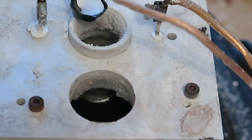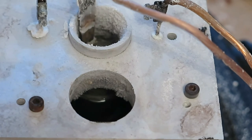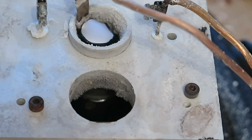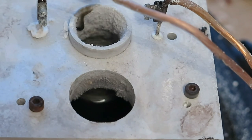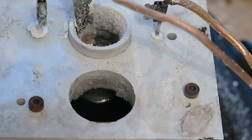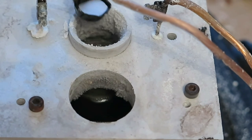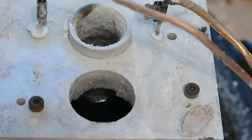Typical yield for this setup is about 10 grams of sodium metal per hour at 40 amps. After all sodium is collected, it is good to remelt the solid in the collection tube before starting a new batch. I didn't run the cell continuously for more than an hour. Shortly after an hour, explosions occur inside the cell. Once, a few grams of sodium was spilled due to an explosion. Also the primary coil of the transformer gets very hot after an hour, but this is only a proof of concept and many improvements can be done.